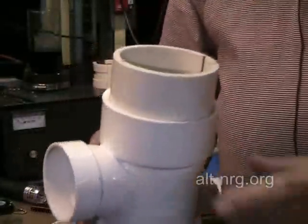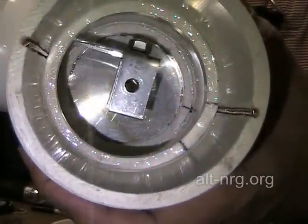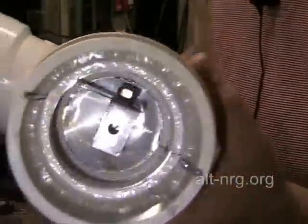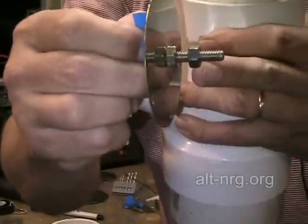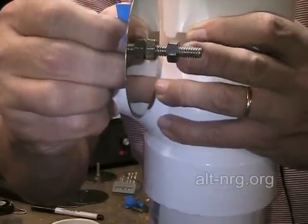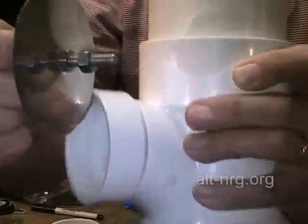I get only one opportunity to show you this before I assemble it, so here it is. There is the inside of the cell showing the end of the U-bracket that I made. I'm holding the plate with a piece of painter's tape and I'm getting ready to insert it. I've already adjusted the height of my backing screw by testing the fit inside there so that it's just about a half a turn too close to the end, so that when I put the nut on this end of it, it's going to actually pull tight just a little bit.